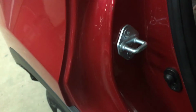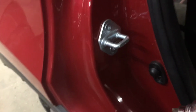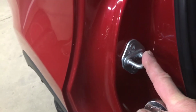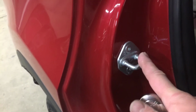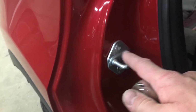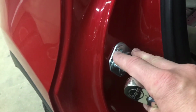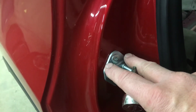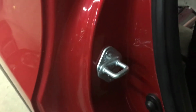Also, you've got to remember that if you're adjusting a door and you can't figure out why it's still a little rough, not quite smooth, the angle of this a lot of times will be wrong. If that angle is a little bit off, the door is going to bind. So you get that right, and poof, all of a sudden the door opens and closes like a champ. You'd be surprised how many guys can't figure that out. So that's that ratchet, and I use that almost all the time for everything.